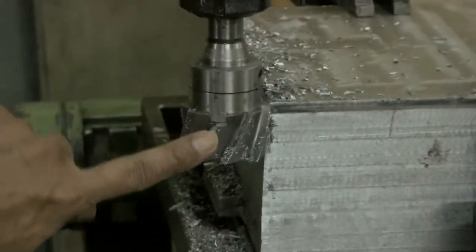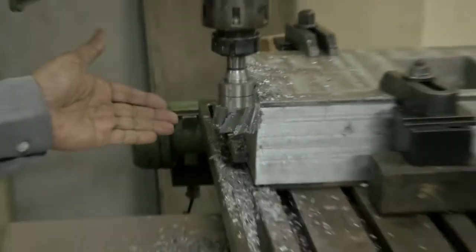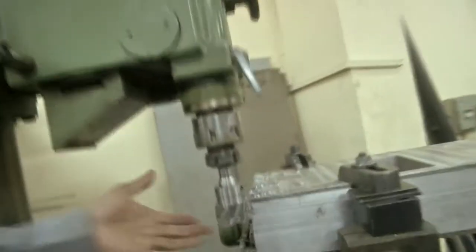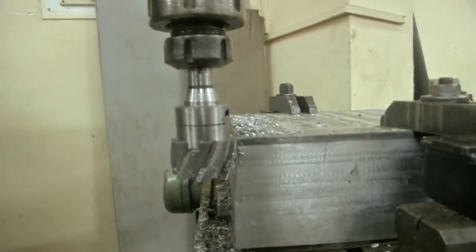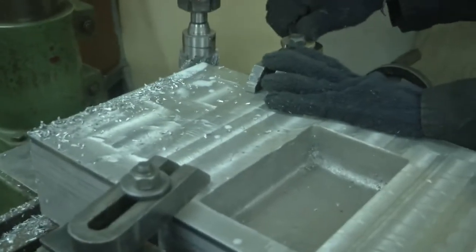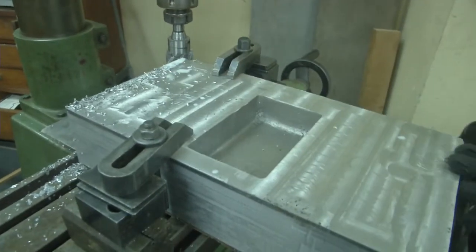So you have all these cutters. This is an end mill, and actually it's a shell end mill. It is both a side and face cutter type of thing. Okay. So you see here, we have chips here, we have everything here, and then most important here is, how do you clamp the device, how do you run the machine. This clamping and all is very critical. Even a small vibration in it completely destroys the whole finish of it.